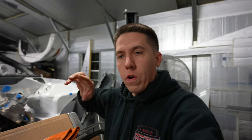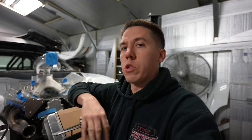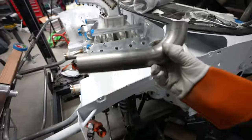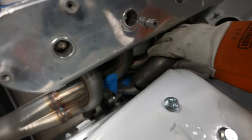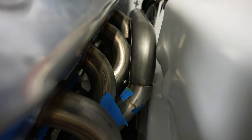Not an ideal situation, but really just trying to take my time and make sure it's going to work. One good thing about going up and over — it might have that bigger tube up and over, but it will allow us to remove the header without taking the column out, which is kind of nice. I'm going to get that pulled out, start fitting up some pipes and we'll take a look at it. I went ahead and cut one of the U-bends that I have, so it's pretty much a straight 90. Something about like that would be a pretty aggressive turn and head back towards there.